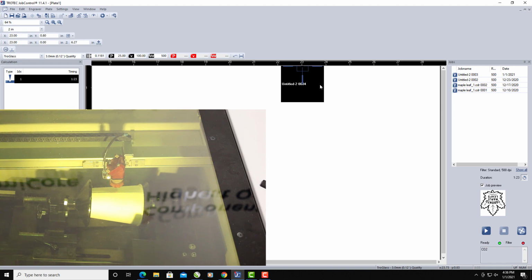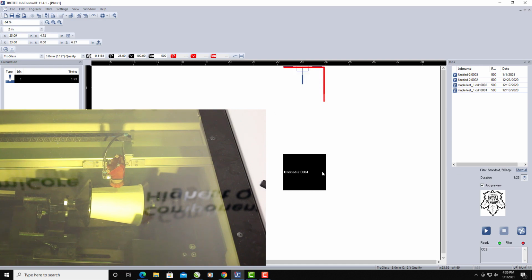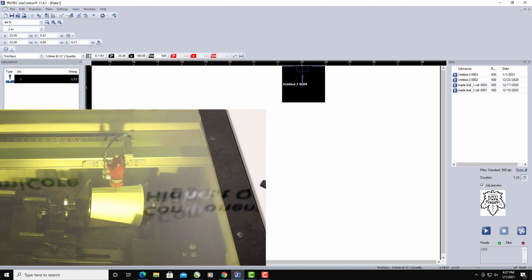And really what I'm trying to show you isn't where you want to have an optimum location for this particular glass. You just need to understand that if I have the logo at the top, then the etching starts right away. If I move it down here, then the glass has to rotate this much before it starts etching. Okay. And sometimes what I'll do is I'll have guide rules out like this, and I'll say, well, this is exactly how far the logo can be.